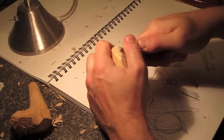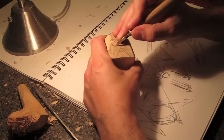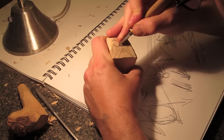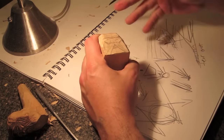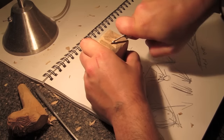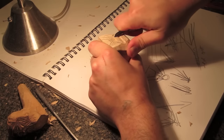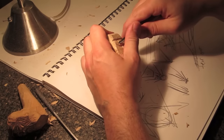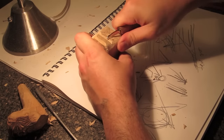Here I'm doing a lot of cuts to make up a v-cut. In the first part of this carving, the tip of my knife was damaged. This pear wood has wavy grain rather than straight grain. Most woods that make good pipe bowls are not great carving woods. It's not basswood — it's a little gnarly. If you make a cut directly with the grain, it'll split because the wood is so tough that the knife will end up prying itself out in front of your cut and split all the way down.